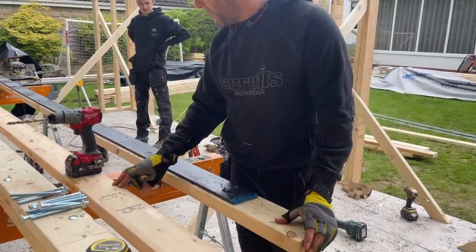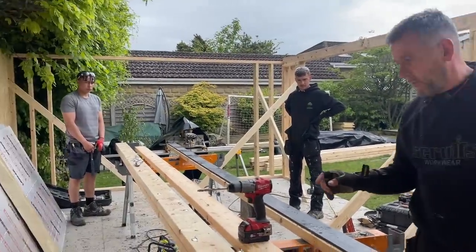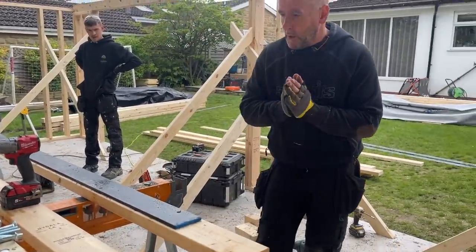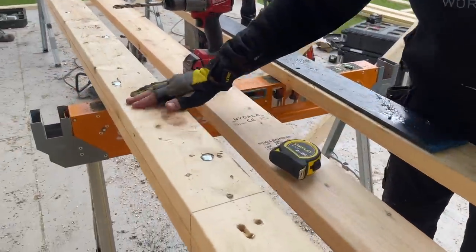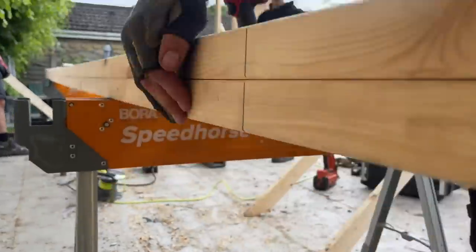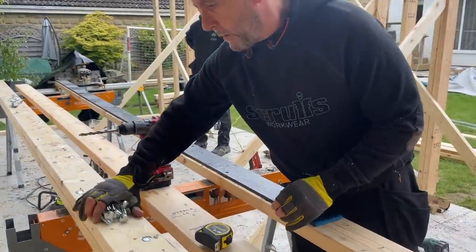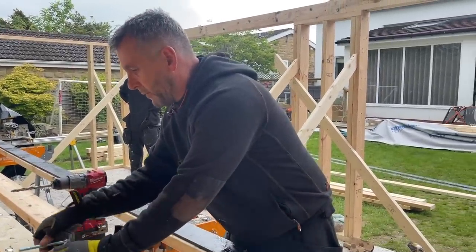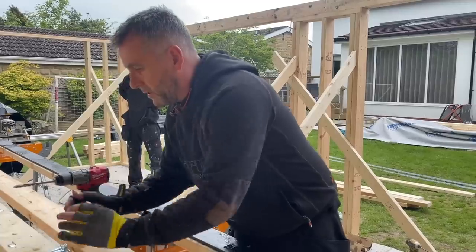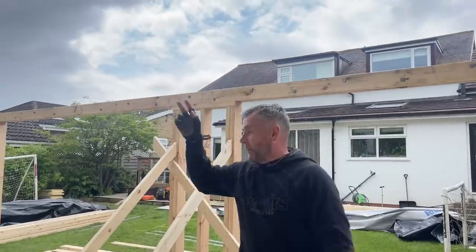Under permitted development you're limited to a 5x2 roof timber, and this is a four meter span so it's too big for a single 5x2. The build pack states you can use two 5x2s bolted together, which this one here is - it's nailed and bolted together. If this was my own garden I wouldn't bother with flitch beams, but because we are building commercially and I need to warranty them, we will have double timber, flitch beam, double timber, flitch beam, double timber, flitch beam throughout.